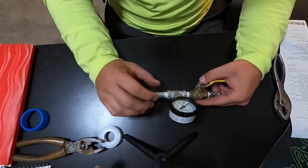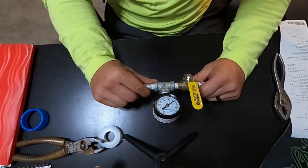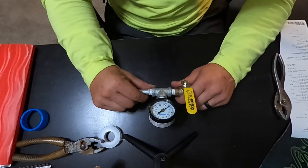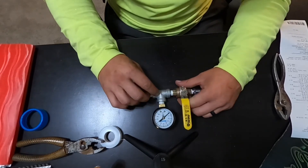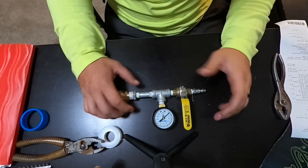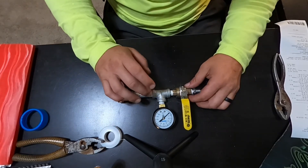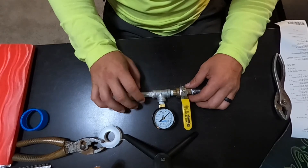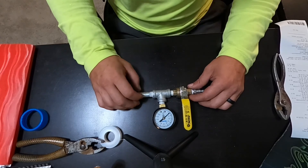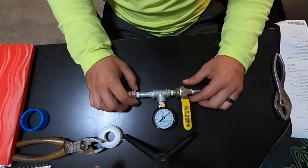When you pump the system up to 35 PSI, all you have to do is turn this ball valve off so the air can't come back out, then wait 30 minutes and see what it does. I really hope this helps you guys out — I know a lot of you have asked me to do this for a while. This is just about a mirror image of the one I've been using, except mine is all brass with no galvanized fittings. Hope this helped — thanks for watching and y'all have a nice day.